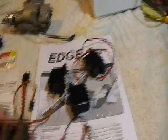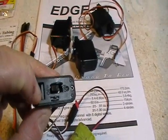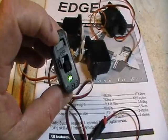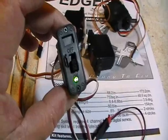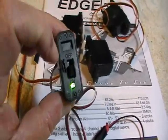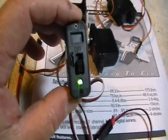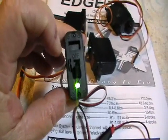Another thing I like are these heavy-duty switches. They've got a charge jack built in with a little door that closes over it. What I really like about these new ones is how bright the LED light is. I especially like these on my gas models for the ignition system. On your regular electronics switch it's not as important, because if you leave a switch on and turn your radio on, your plane starts chattering and you can hear it. But when you forget to turn your ignition switch off, you have no way of knowing — and if you run your LiPo battery down past a certain point, it will ruin it, and you'll be buying another $30-$40 battery. So these switches are really, really good for ignition on gas planes, which is what I'm putting this one on.